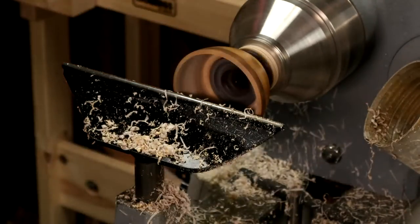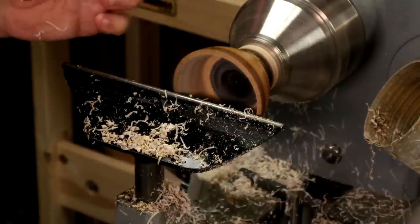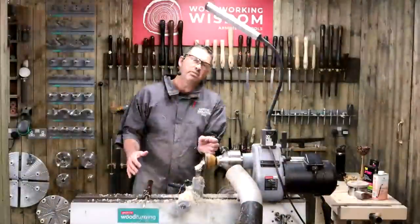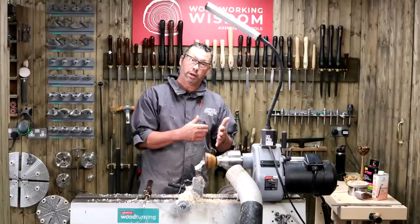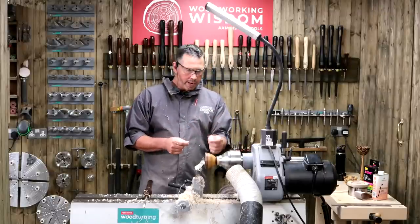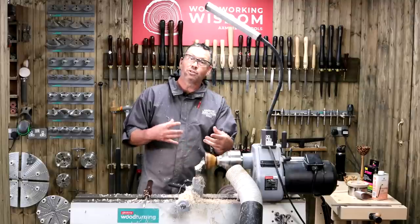So you see what we're doing? We're doing one stage at a time, taking about 10 mil, 3/8 of an inch away at once, and then moving down to the next stage, taking away the join line at the same time as well. We're now down to about halfway, so I can now start taking out the bottom.